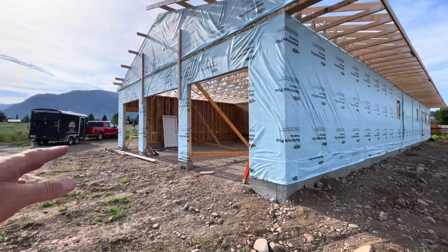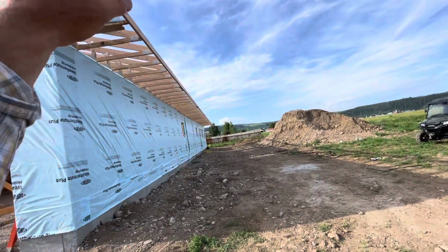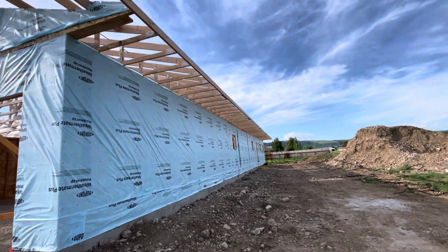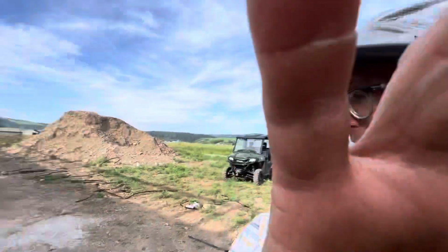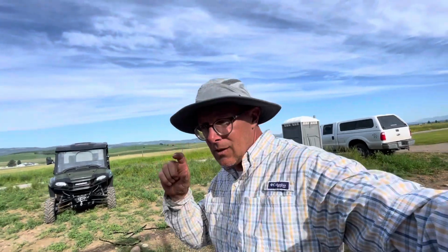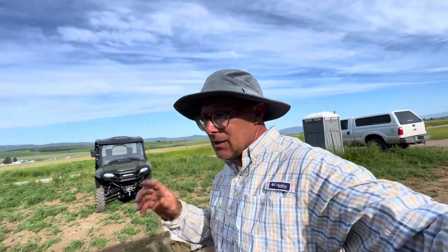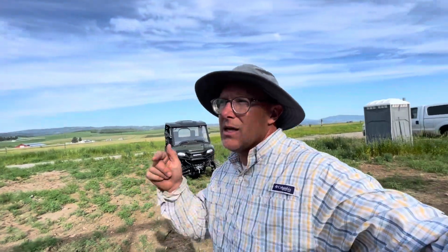So we're gonna lift the sheets with that unit, the lift, and come around, lift them up, and should be a nice steady process with 2 guns. We'll have 2 staple guns going, and we're using those 7/16 1.5 inch 16 gauge staples that Greg talked me into switching over to when I sheeted the garage. They're so much faster than the 2 3/8 nails for sheeting.